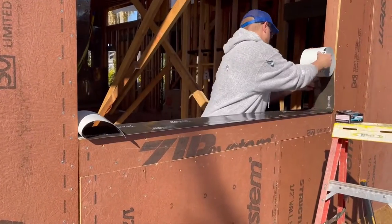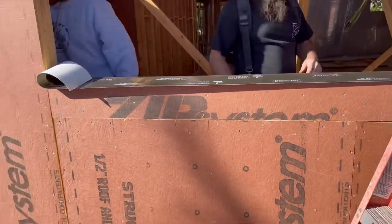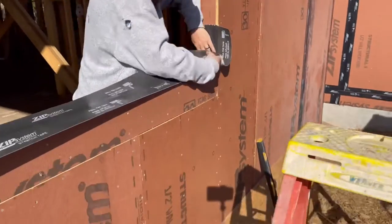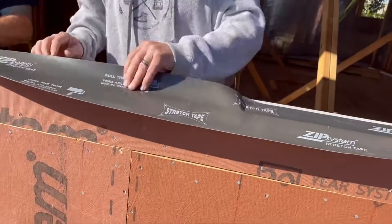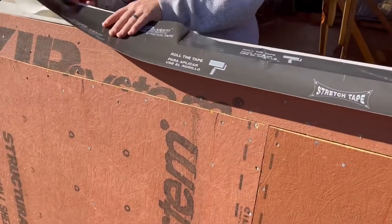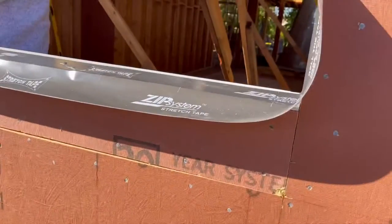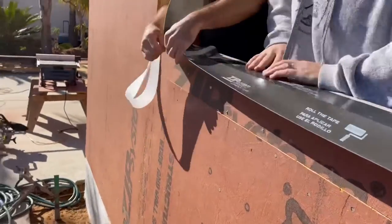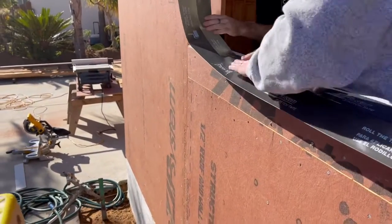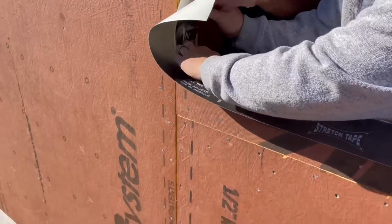Matt and Pete are preparing the windowsill with this stretch zip tape — some real amazing stuff. The nice thing about this stretch zip tape is the zero cuts on the inside corners of the sill pan. Another thing we found is it is much easier installing this very sticky product to remove the paper a little at a time and then stick it down, kind of like you do with a sticker. We're keeping our clearance about half-inch. This wall is only a 2x4 wall, and we like a good amount of the tape to be in the sill itself. So we're about half-inch in, and our method allows us to keep in line with that pretty well.